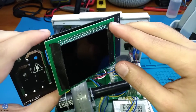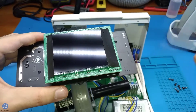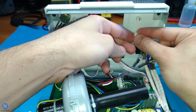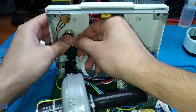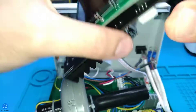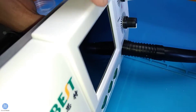The display actually has a very glary protective film that you can remove. Install the included spacers, making sure the red line is pointing towards the top. Install the board and check if the display is in the correct position before tightening the screws.